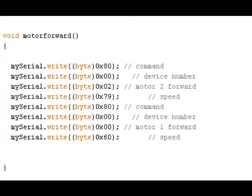You'll notice in this code that I have the motors moving at 2 different speeds. This is because I had a problem with the right motor on the Rover, which would spin slower. To offset this, I changed the code to make the left motor move even slower than usual.